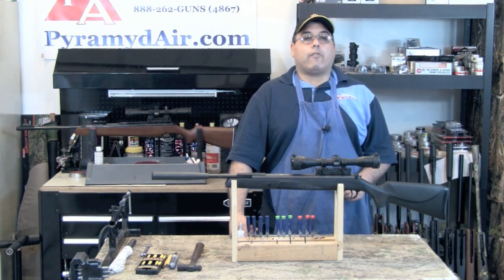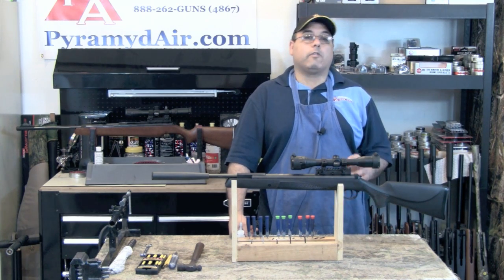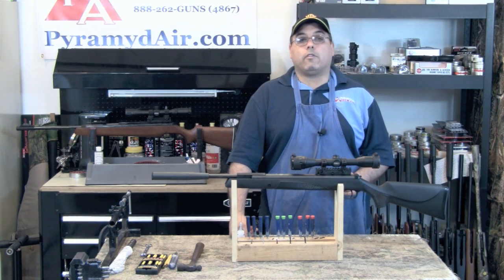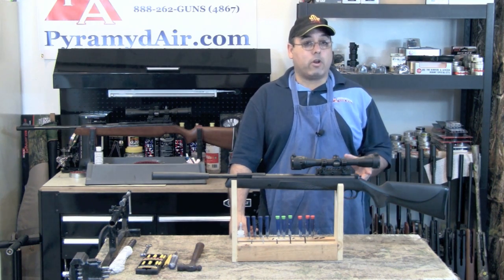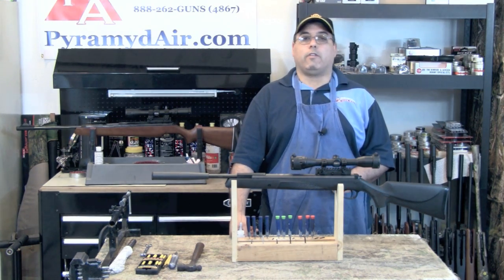The only thing you're going to have to remove on your gun to try this simple fix is the stock. This exposes a good bit of the spring inside the compression chamber. Now I'm using the RWS cleaning and maintenance supplies that we used previously on Take Aim, specifically the RWS spring chamber oil and the needle applicator. Also, before you get started, make sure you have a way to securely work on your gun. Don't try this without a gun rest or some other similar device.